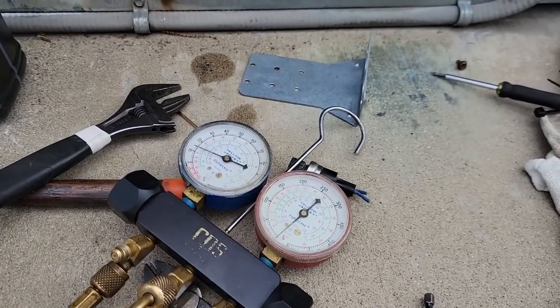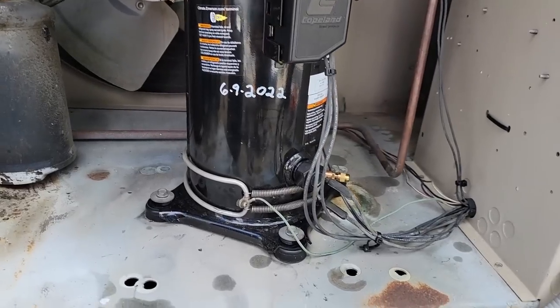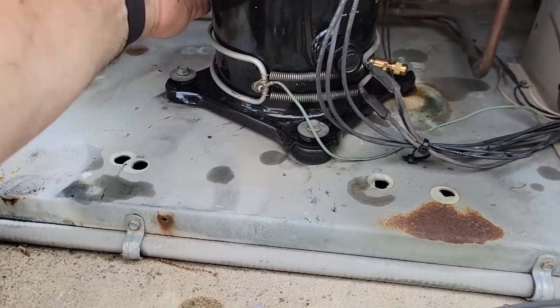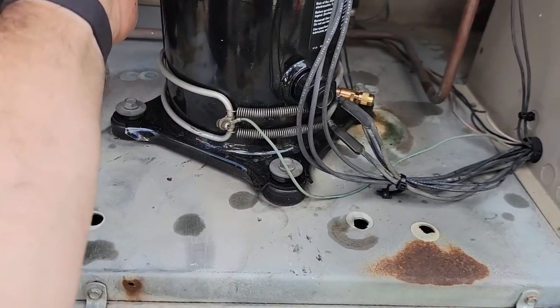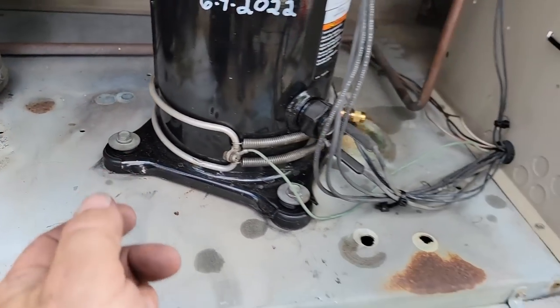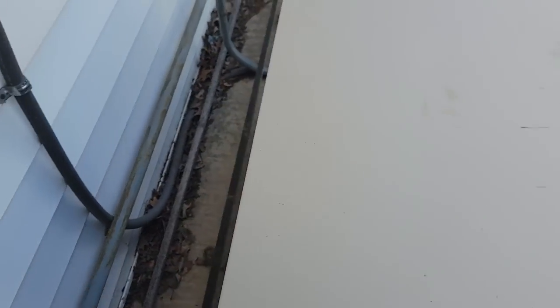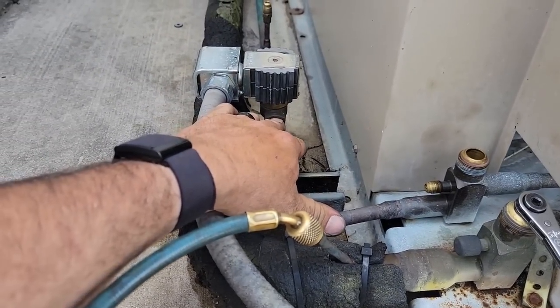It has an unloader at the end there anyway. You know what, it's holding pretty good there, I may just leave it alone. I'm running my vacuum — scrolls do not like that. That heater is working — boy oh boy, that bad dog is hot. I probably should have rotated that to put it across that part right there and have better contact. Now we're working on this one. So I've got both valves cranked down on it, pumped it down. There's no pressure in there. I'm going to kill that, so now we can remove this away from the valve and then we'll go ahead and get that thing removed out of there.